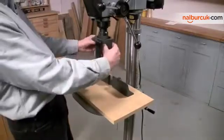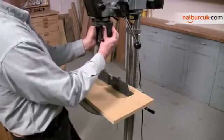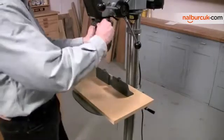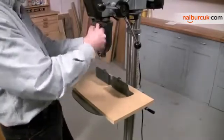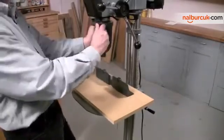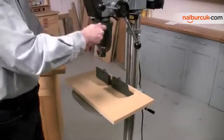After that, I'm going to slide the chisel holder itself, keeping the split in the front of it aligned, and now I just tighten it down. It's important to tighten this snug because you don't want this thing to slip when you start cutting the mortises.